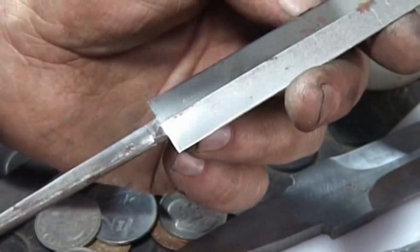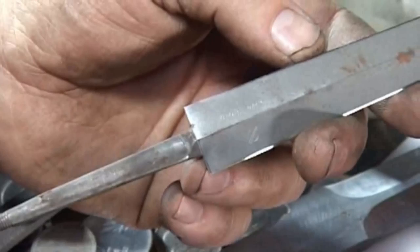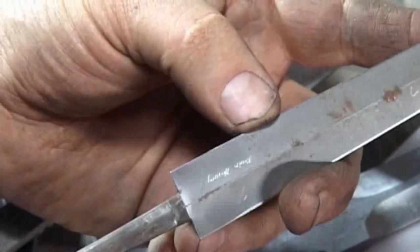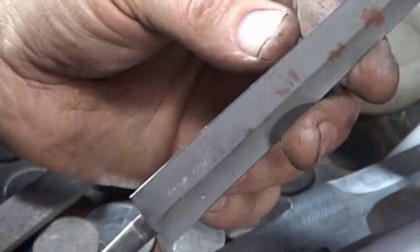Narrow tangs can and should be strongly constructed. These skinny little rat-tailed tangs, or where people are drilling into the back of blades and screwing high tensile bolts, that's not a strong construction. Sometimes it's justified by people saying it's an art knife, it'll never be used. Well, I don't always follow that argument. Every knife is a using tool. It should be. All right, thank you very much.